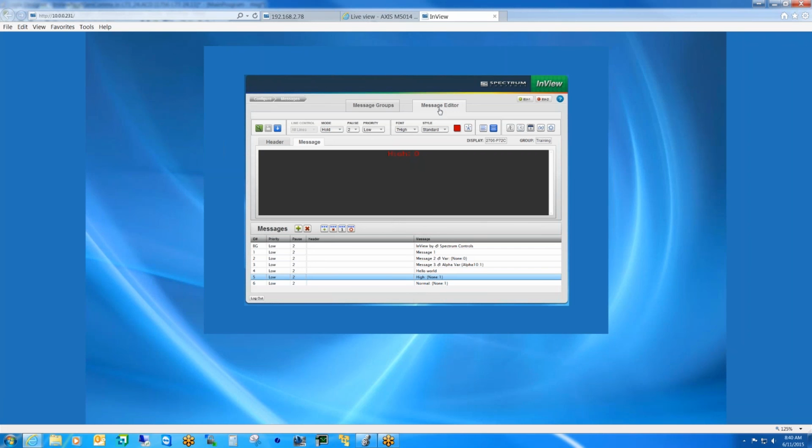We're doing this in stages. When we took over the line from Rockwell, the first thing we had to do was redesign the comms module because they were obsoleting all the hardware. That was step one. Step two was to make it as easy as possible for the user to configure, because the old IMS software was very flaky. It was Windows XP compliant only. So that's why we came up with this web-based interface.